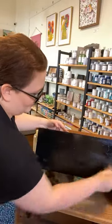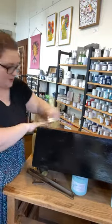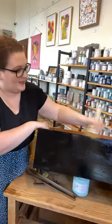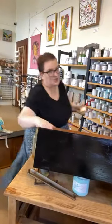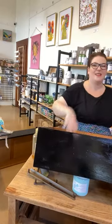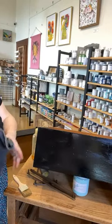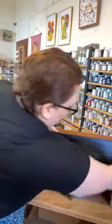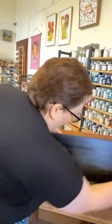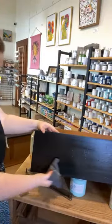All right. So just like that. Make sure that we get it all down there. Don't forget your edges or your top. If you miss anywhere with the hemp oil, it is easy enough just to go in and touch up any bits that you've missed. So don't stress too much. Whereas a top coat, it's that little bit harder. So yeah, really, you don't have to stress with hemp oil at all. Take your cloth again and make sure that you're giving it a good wipe down. Remove that oil. You just don't wanna leave that really thick layer of oil on there, okay?